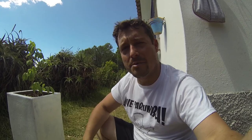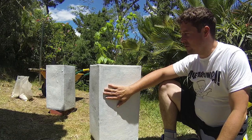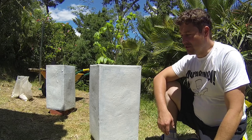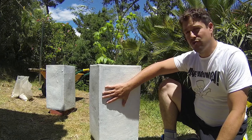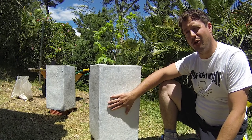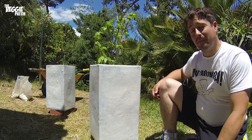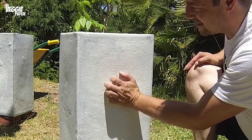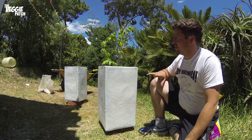It's been about four hours since I painted this — it's about three o'clock now, the hottest part of the day — and just feeling this pot it's only warm to the touch. Before you'd touch it and it was almost hot to the finger. You can tell how much heat this white paint is really reflecting. And this primer — look at that — it's not coming off, it's given me a nice good surface to put on the finishing coat.